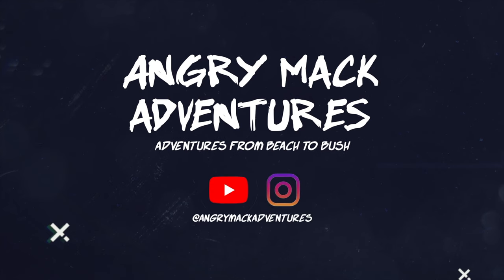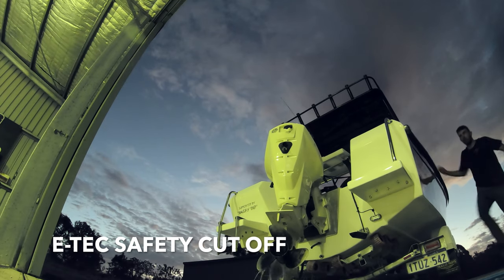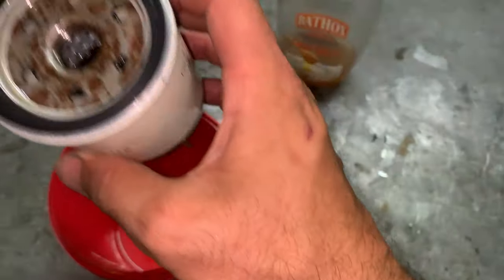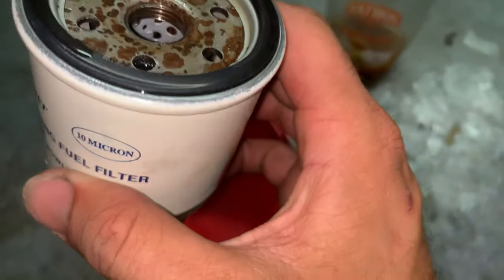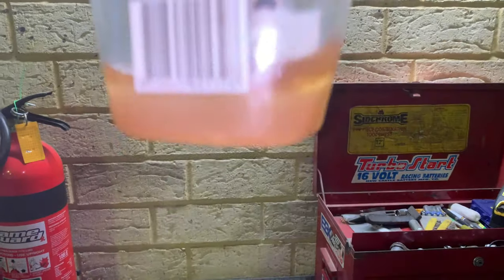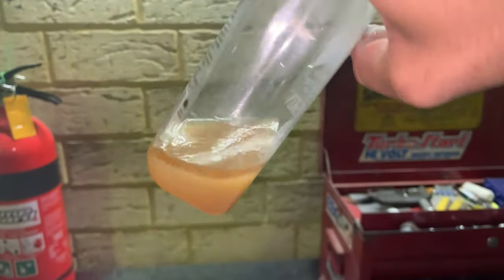A great thing about the Evinrude E-TEC is their safety mode, or limp mode. When it's not performing at 100%, it either alerts the driver by cutting the engine off or setting off an alarm to prevent any damage. When I was in Exmouth the engine went to limp mode, signaling that I had water in the system. That comes down to three things: one, contaminated fuel from the bowser; two, condensation; or three, coming from your filler cap or breather. You can see the fuel separator system's definitely doing its job.